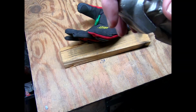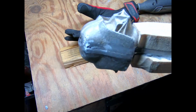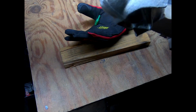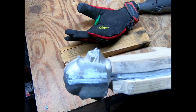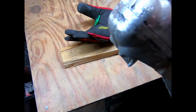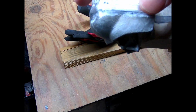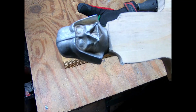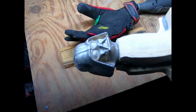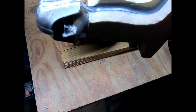Okay. Perfect. Well, this is all cast material. It's not machined. I think that's doable. Of course, this will all get polished up real nice. A little rough here at the top, a bit of pitting. If I remember right, when I cast these, I cast them in the single flask rather than the way I normally do in a wooden flask and flat. These were cast vertically. Anyway, let's work on the handle here. Get a little bit further.